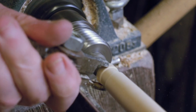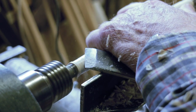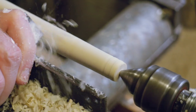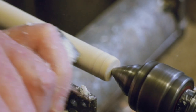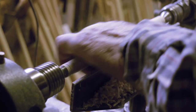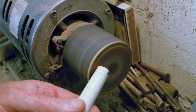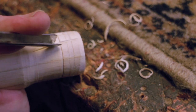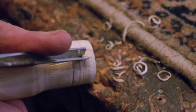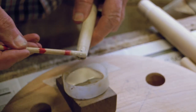The sizer is adjustable as all 5/8 inch bits are not the same size. Because my lathe drive and stretcher tenon are the same diameter, I am using a sanding drum to create my end bevel, otherwise there is a chance that I might damage my skew chisel. I cut a channel with a V chisel to allow excess glue to escape from the blind socket. At the start of the legging up process, place them in their correct positions. I use a piece of 6mm dowel to put glue on both tenons and sockets.